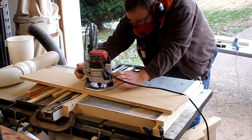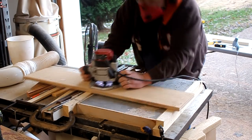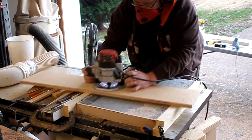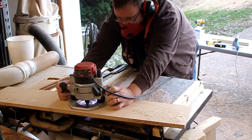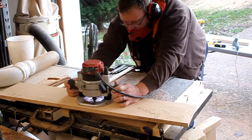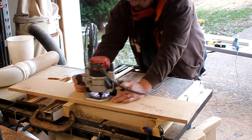I was never really able to get a good flat surface with a belt sander - I tried and tried and I just couldn't do it, there were still divots in it. So I wanted to make it perfectly flat. The only way I knew to really do that was to make this really quick router sled - just two by fours that I clamped to my table saw, cut a hole in a board and hot glued the router to it. It worked really well - a great way to flatten your project.